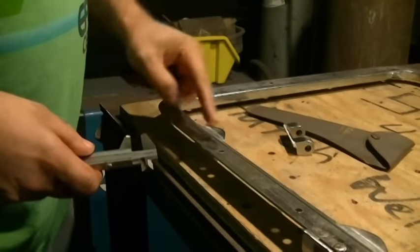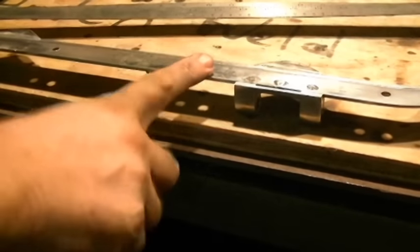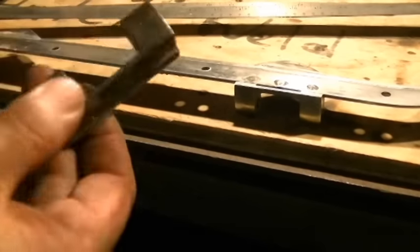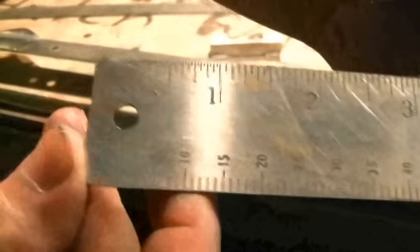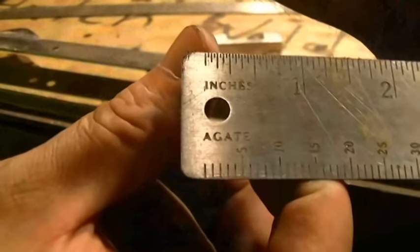So now I know I can't drill beyond this point. The next step is to measure the distance from this hinge to the side of the other hinge — get my spacing right. If the spacing's off and I weld this, it's not going to line up with the lid and it'll never be able to be reassembled. I want to stop for a second and have a little rant. I'm going to be using a steel ruler for laying out the distance left to right, and I wanted to point out something — see how there's a gap between the end of the ruler and the first sixteenth?